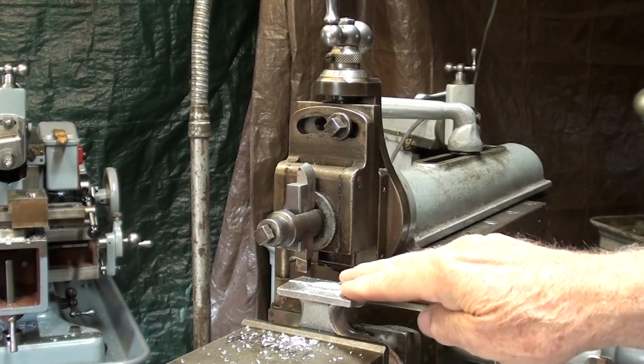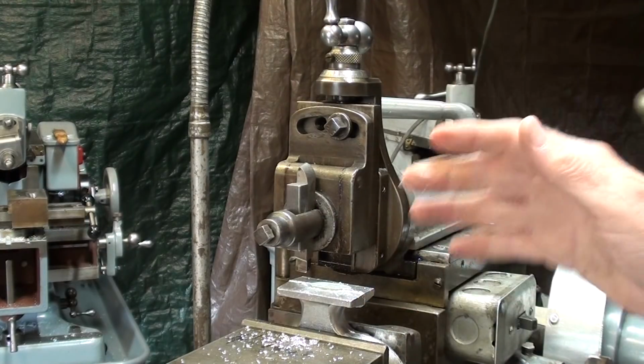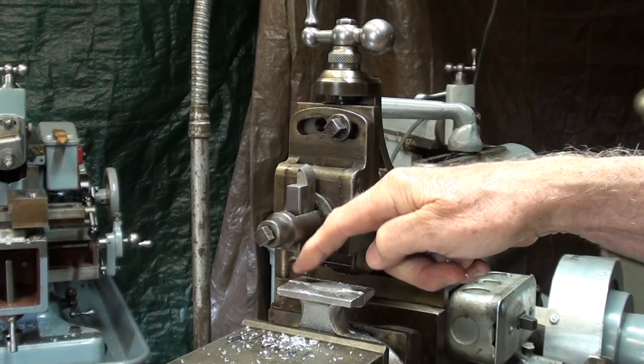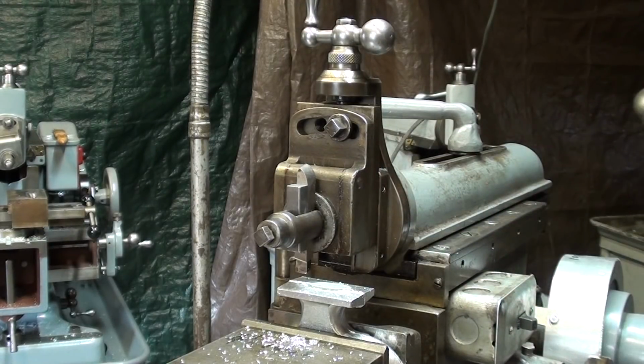Now the trial cut just allows me to know that I have the machine set up, and I'm still kind of tentative about this, but now I'm going to take 25 thousandths off and I'm going to start all the way from the edge. Again, it will not even begin to clean up yet, so I won't show all of that, just some short little bits.